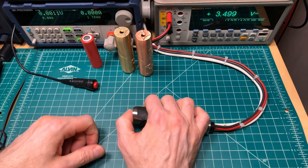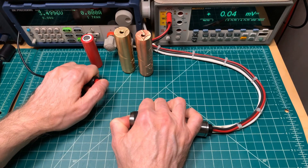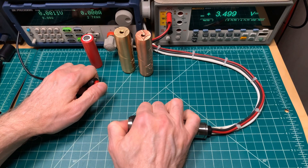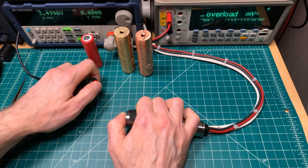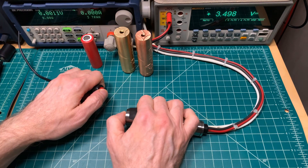There's much better grip I can get on it now. I'll press the button to make sure we're at zero, and fire a two-second pulse and read the voltage: 0.27, 0.35 — right now that's about five times the voltage drop of the Tauren Max, which is very high.